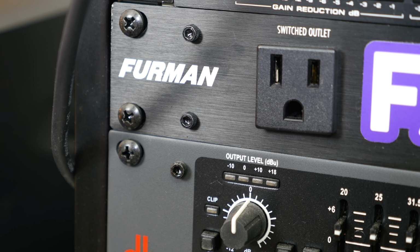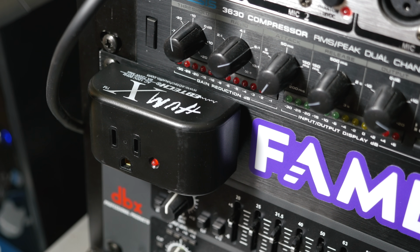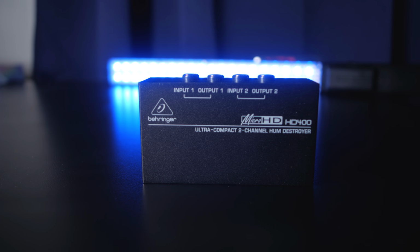I bought a power conditioner to run all of my audio gear from. Bought a lot of those Hum X per plug ground loop fixers. Nothing was a complete fix. For basic audio run through, the mixer was totally fine, but add post-processing or anything like that, amplification, and that brought up the hiss and noise a lot. Nothing truly fixed my issues until I found another Behringer product, only just in January of this year.